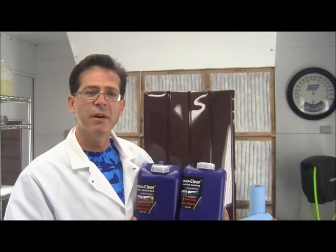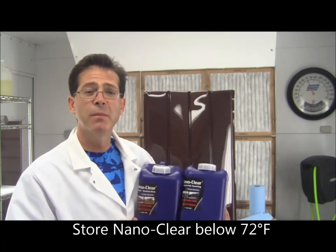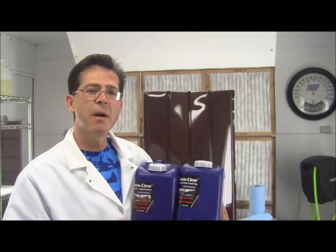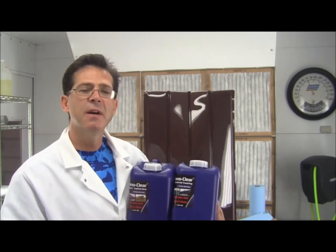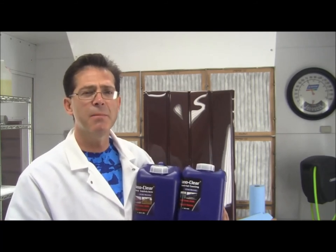When storing Nano-Clear, it's very important to store below 72 degrees, or room temperature. Storing Nano-Clear above 72 degrees Fahrenheit will decrease the package stability and potentially cause thickening of Nano-Clear, which will negatively impact spray and leveling.